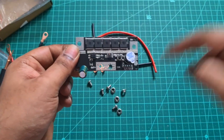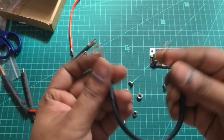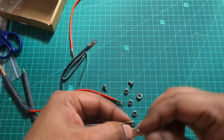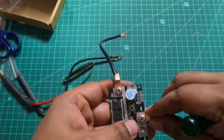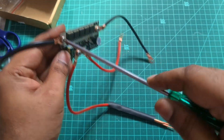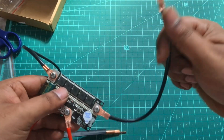I've now soldered the capacitor and the beeper, and I've also crimped the lugs. If you want a good quality crimper, I'll leave a link in the description. On the top you have the negative in — let me screw everything in. One important thing: buying a spot welder is fine, but you need to use proper quality batteries — at least a 3S high-discharge LiPo, or better yet a car battery.